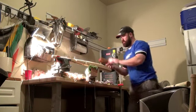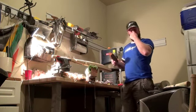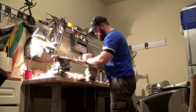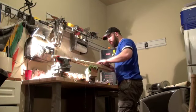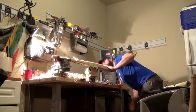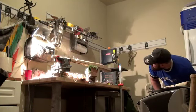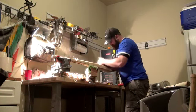I'm quite light in the way that I press on here because I want it to skip. If it's catching something, it's raised. If it does skip over, then I know with that hand as a guide, I've got the rough height that I want, and I'm not trying to tear lots of material out. I want the blade to follow the nodes that I've set, so I can dictate the shape for this final stage.